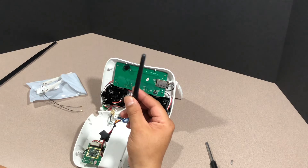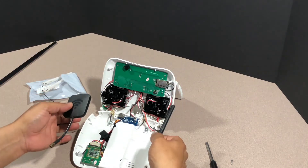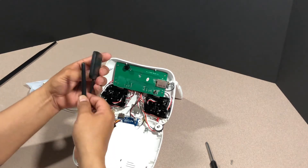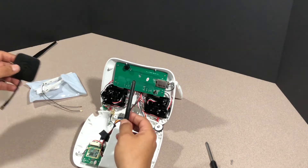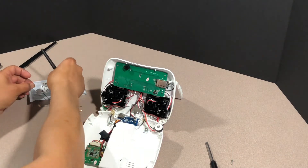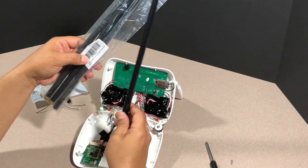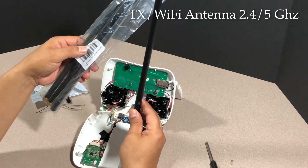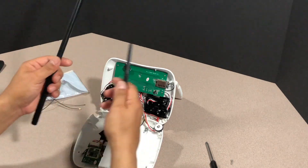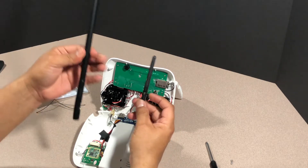This was the original antenna that came with the kit. So basically you'd have your WiFi to the left — this is what the controller facing as if you were holding it in your hands. WiFi to the left, make sure the WiFi emblem is facing you, not in the other direction. I wasn't happy with the length of the antenna that came with the kit, so I ended up getting these WiFi antennas from Amazon as well — I'll put the link. These are rated at 10 dBi, as opposed to those small ones which were rated at like 2.3 dBi, maybe 3 dBi at max, so you get better range with these.